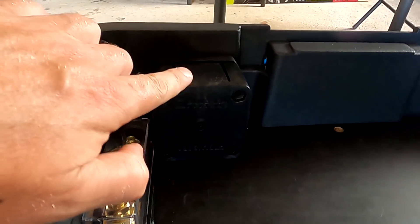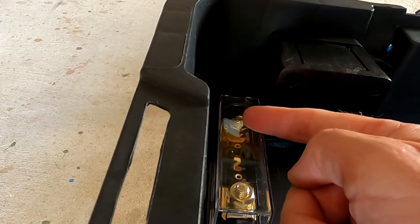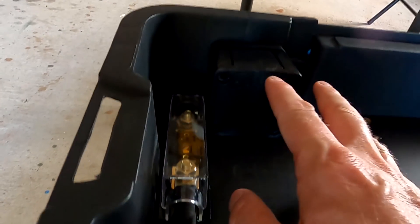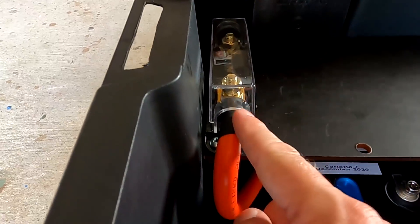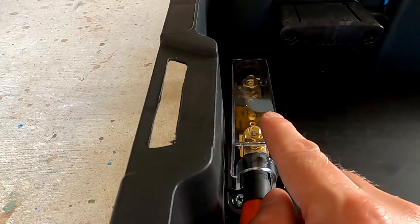That's how it will look when everything is ready and tightened. I decided to put the switch in first because the cabling is so much easier. Otherwise I'd have to go to the fuse first, then loop back and loop outside again — just too much cabling. This way was much easier and I left the cable just long enough to take this board out without disconnecting anything.